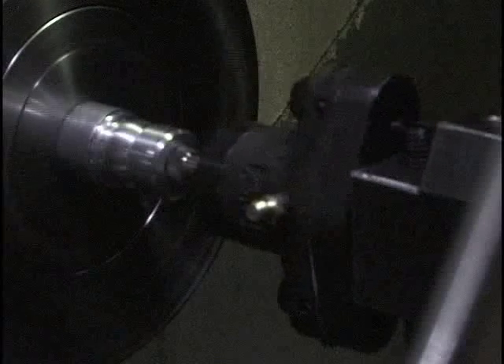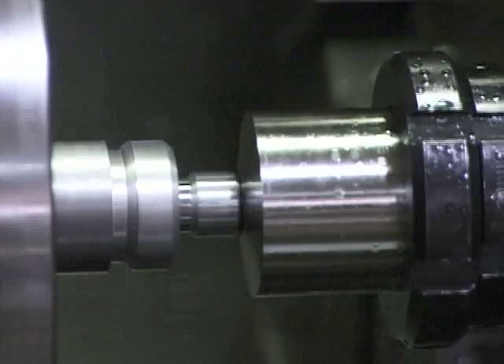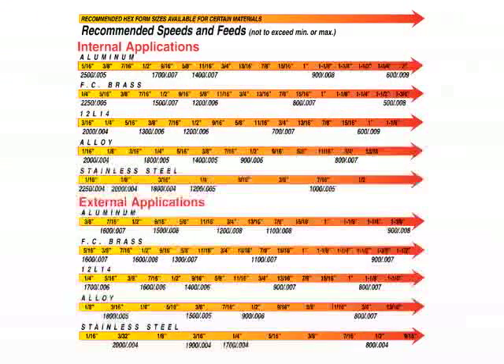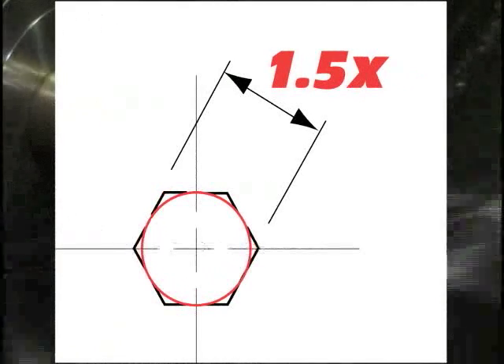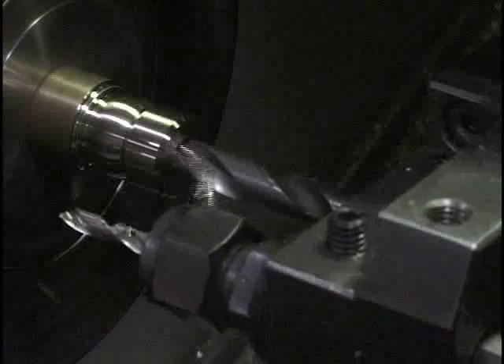Form sizes can be broached up to two inches in aluminum, one-and-a-half inches in brass, and one inch in steel. Of course, many other materials and depths are being successfully achieved every day, and this is only a point of reference. Speeds and feeds can vary relative to workpiece configuration and material. The practical forming length of rotary broaching is up to one-and-a-half times the distance across flats or the diameter of the inscribed circle of the profile to be broached.